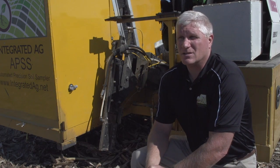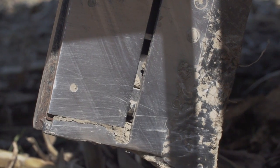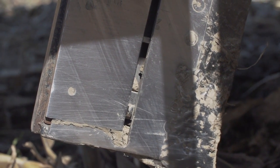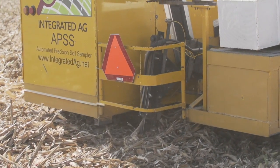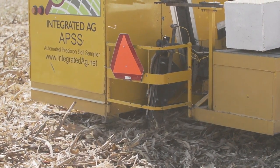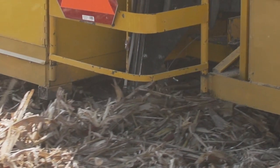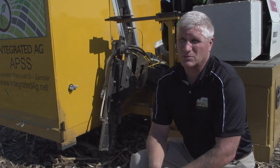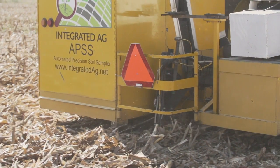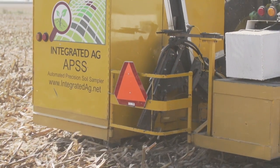What makes our system unique is instead of taking a soil core, we're taking a furrow slice. You can see the knife here has a slot in it, and inside that knife is a cavity, and that cavity fills up with soil. This accomplishes two things. First of all, it allows us to take an exact soil depth every time. We use the tractor and the tractor's hydraulic system to make sure that the knife goes in the ground exactly seven inches every single time it takes a sample. The second thing it does is, because we're taking a furrow slice, it allows us to take samples and not have to stop, so we can take samples as fast as one every 15 seconds.